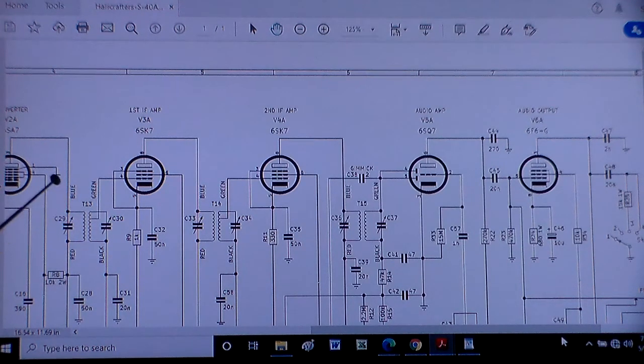That's the good point. If you put 455, it'll go right through with no problem. If you put 555, this is going to block it — it's going to be high resistance, not letting you through. It'll let the 455 through. So once you have your intermediate frequency set and you set these two capacitors on each one to 455, that's the first part of your alignment procedure. Now you know you're good — everything with 455 kHz can get through, everything else gets blocked. It's kind of like a nice filter.